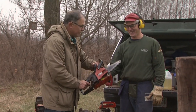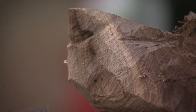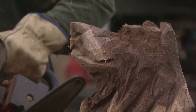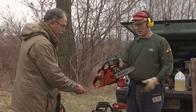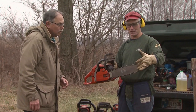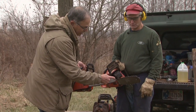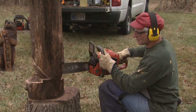This other bar is intriguing — it's actually a cannon carver's bar. The tip is the size of a dime, meaning a dime tip. They also make a quarter tip. This one is an eight-inch. They make them from eight, ten, twelve, fourteen, and eighteen inches. This saw right off the shelf has a twelve-inch bar, and this sixteen-inch one is different in that it doesn't have a sprocket on the end. Without a sprocket, it's better for plunge cutting — it just floats in that smooth groove when you go straight in.